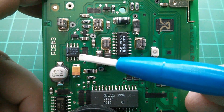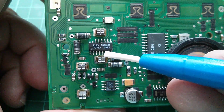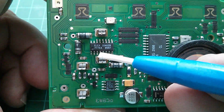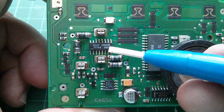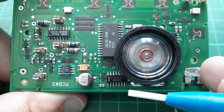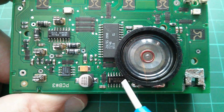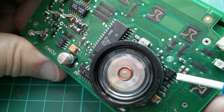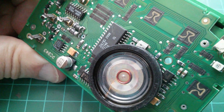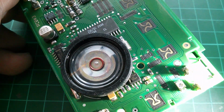We've got an LM293 there. Is that an op-amp or comparator or something like that? There's an odd thing here. It's this, whoops, it's this LX, now what would it be? A 7774? Is that actually perhaps something like a 7474 flip-flop or something like that? Maybe, not sure, might have to look that one up. There's an HCT04 here. That's just a set of inverters, HC04, 7404 that is. And there's a little 8-pin device here. Can't quite see that one at the moment. Okay, yeah, that one's an LM358, so I'm pretty sure that's an op-amp.